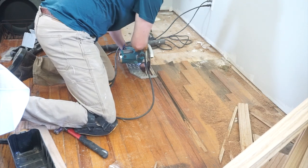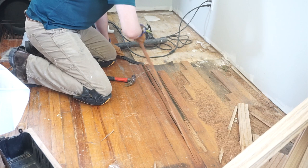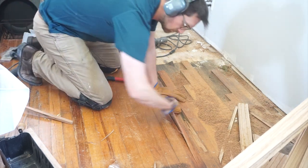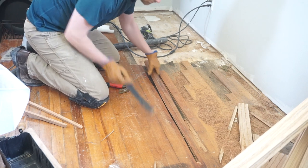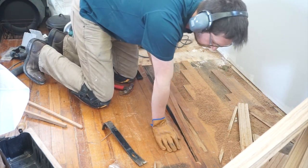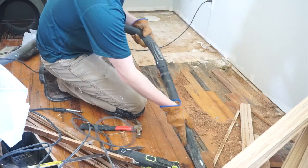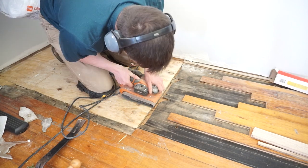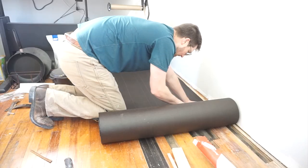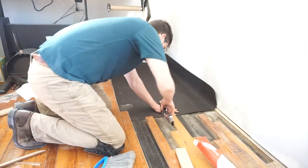Since we're connecting our new flooring to old existing flooring, we want to feather the ends of our boards out. I'm going to remove what's left of the cutoff ends of the board from where I needed to create the patch for the subfloor. If you have to remove a piece of flooring sandwiched between two existing pieces, cut a strip out of the middle and then you can collapse the board in on itself. Remove any dust and chips from the grooves so we can get a seamless transition. I sanded my plywood edge down a hair just so it was completely flush with the existing wood and then covered it with tar paper.